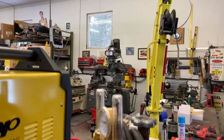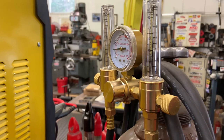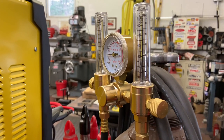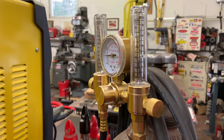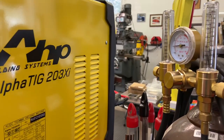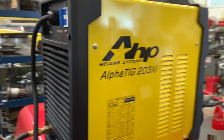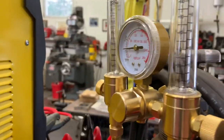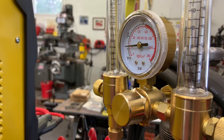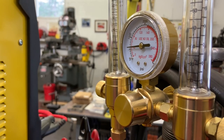It's the next day, as evidenced by the daylight coming through the window. I used this dual regulator I had purchased six or eight months ago — I was going to build, and still am, a purge setup for welding stainless. The machine came with a single regulator, which I'm sure is fine, and a short hose. I just connected it sitting on top of my Lincoln 275 TIG, ran one hose back to the Lincoln and another over to the Alpha. I actually opened it last night and closed the hand valve — only lost about half of what was there. It never held overnight before. Not bad.